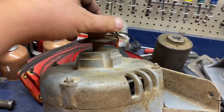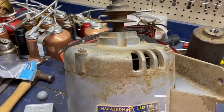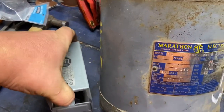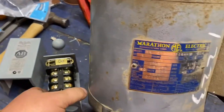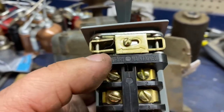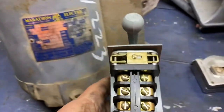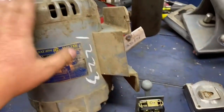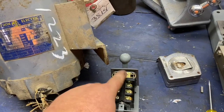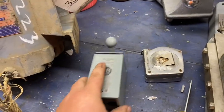Obviously I don't need to upsize that pulley. The pulley size on the other one is five and a half. I'm also going to do another slight upgrade. The Camelback drill press already has a drum switch on it. I have this Allen Bradley one, and you can convert it from maintained to momentary just by loosening that screw and flipping this over here. So if I ever want to power tap on this or just be able to jog it, I'll have that option. So I'm going to go ahead and replace the drum switch with this guy just to make it a little more versatile.